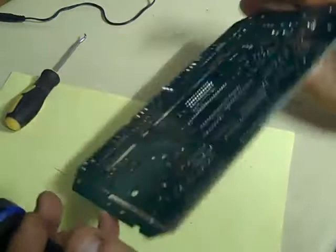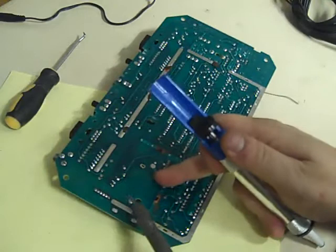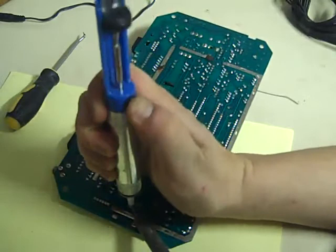While we're in here, all we're going to do as well is take the solder away from that hole there that we're using. That modulator hasn't been used with the other type of modulator that you normally see, this is one of the fixing holes. We'll just suck the solder out of that, and you'll see why I've done that a little bit later.